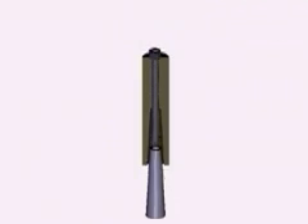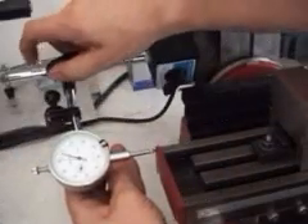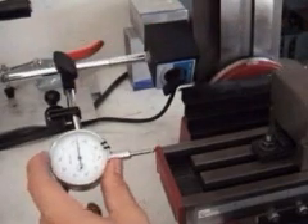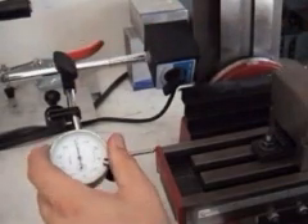We'll move along from there and build on the skills we learned in Volume 2. We're going to take a dial indicator along with the wiggler to enable us to change directions in our mill without incurring any backlash errors, and retain our accuracy to better than a thousandth of an inch.